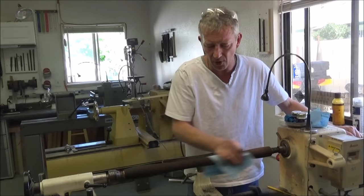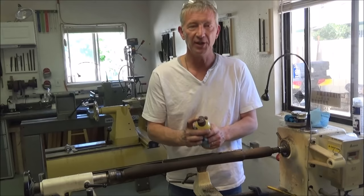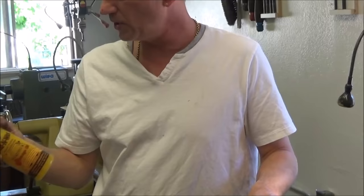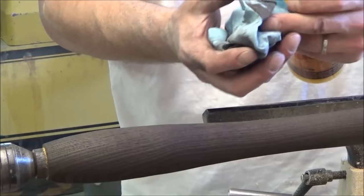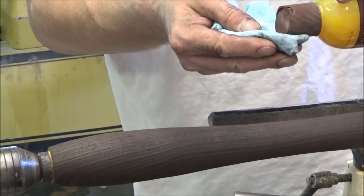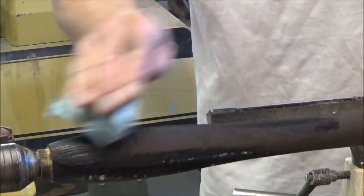Just going to wipe off the excess dust and make sure you get rid of all the loose stuff. Now, what I'm going to do — that wood's still hot. I'm going to use Howard Feed and Wax. You can use various products — we used Briwax ebony at your place, a black wax, which would be perfect to fill any missed bits and give a jet black finish. What's going to happen here is I'm basically using a soft paste wax, which is going to mix with the carbon still left on the surface of the wood and give me a really nice finish. Now, you'll see the wax really soak into the wood — it's hot and the capillary action is going to draw it right in.